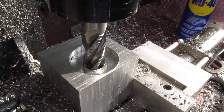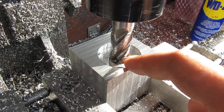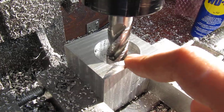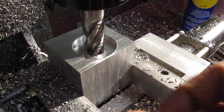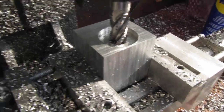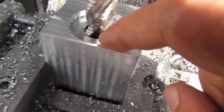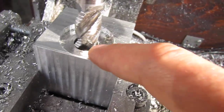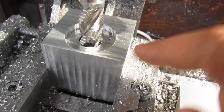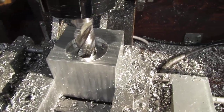Today I'm cutting the hole where the ball screw nut goes. This is the block I'm intending to use for the y-axis. The depth of cut is about two millimeters and I'm going in two millimeter increments on the sides with circular interpolation. It's gonna get a bit noisy because I'm gonna start.